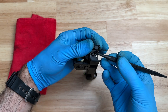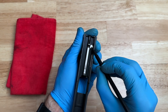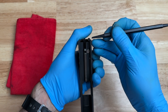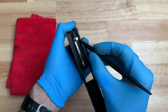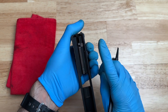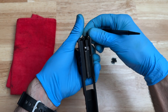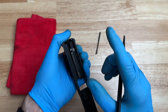That other click was the striker sleeve hitting my thumb. Same thing for this next part — this little piece right here, you're going to compress it downward, but keep your thumb on this whole area because the extractor spring is still under tension. As soon as you push this little plunger downward, you'll release that pressure and the extractor spring can go flying out. I'm going to push down — you hear that? That was me releasing the pressure. It hits pretty hard; you can feel the authority that it comes flying out.